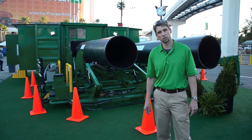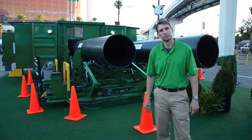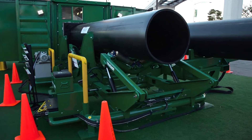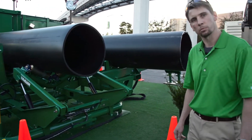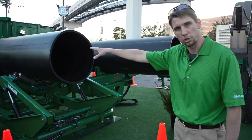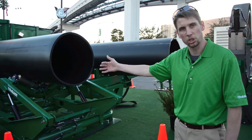It's a quickly deployable shelter for doing pipe fusion in. Right directly behind me is a pipe handling system that we've had on the market for the last three to five years. This allows you to load a rack of pipe for a day's worth of work on the MegaMac Polyhorse. You dispense the pipe one at a time into these pipe stands here — one roller and one track stand — which allows you to align the pipe with your fusion machine and then insert it into the machine.